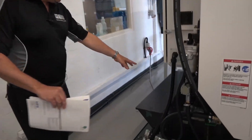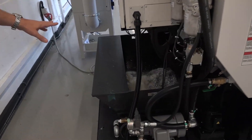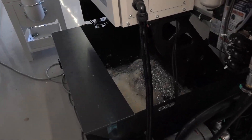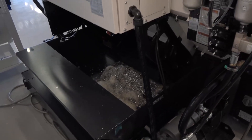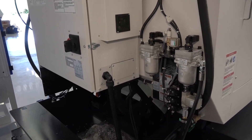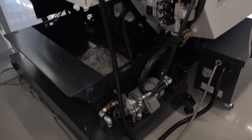Coming around the back, there's no swarf conveyor — and there's no need for one. You can use the flood wash to push the swarf into the back of the machine and then literally remove the swarf from there. Everybody's looking to save space, so if you don't need a swarf conveyor, that's obviously advantageous.